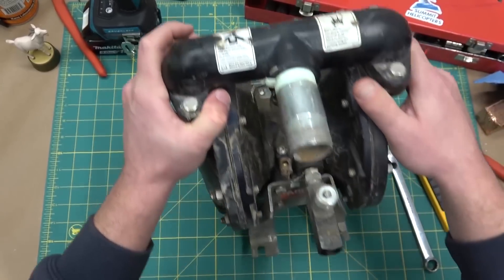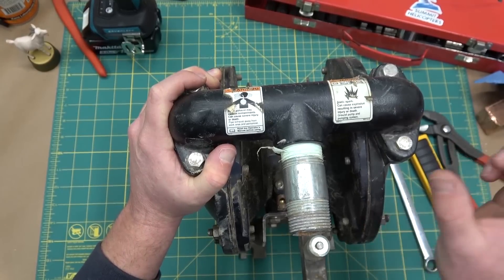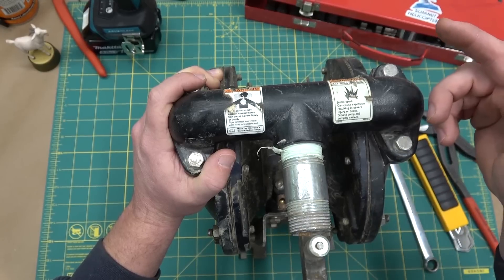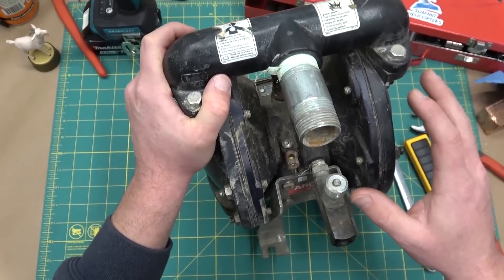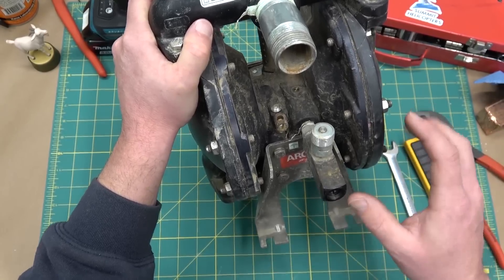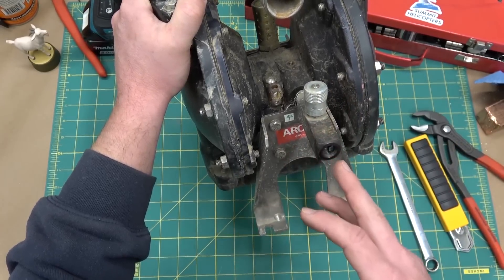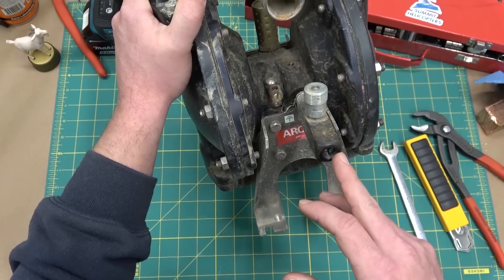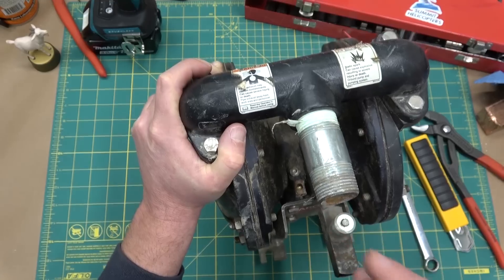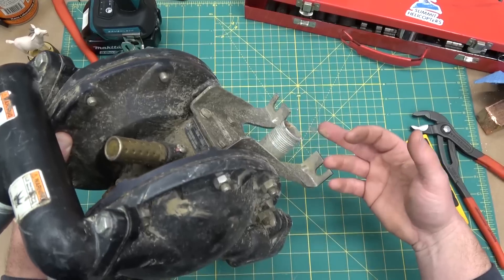So how it works. Some say this is a positive displacement pump — a positive displacement pump just means for a certain stroke or rotation, you get a specific amount of fluid out the outlet. However, because the prime mover is air, and air is compressible, we do not get positive displacement; we get fixed displacement. For every chooch of this, we get a certain amount of chotch coming out the tail end. This guy is one-to-one. So if we put in 120 PSI of air pressure, we will get out 120 pounds of pressure head. It also has extremely good suction characteristics, self-priming, and it'll pull 20 feet of suction no problem at all.